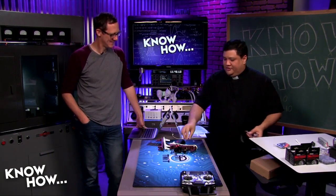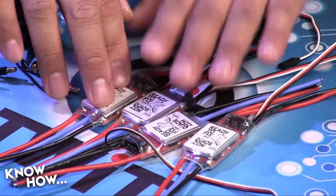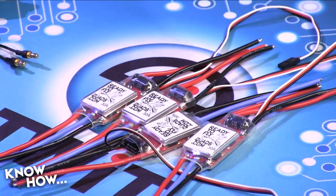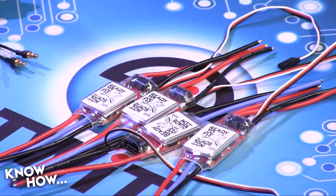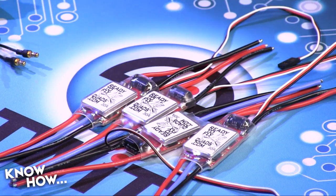To actually control the motors you need Electronic Speed Controllers, or ESCs. These are 30-amp ESCs from Ready to Fly Quads. The 30-amp rating is actually over-spec for this build — you could get away with 20-amp — but the headroom and robustness makes the upgrade worthwhile, and they're the same price. The host has never burned out a 30-amp ESC, but has burned out plenty of 10s and 20s.